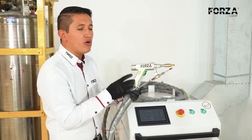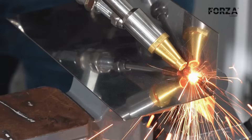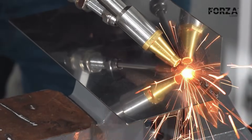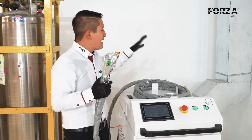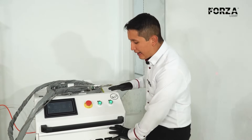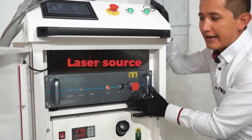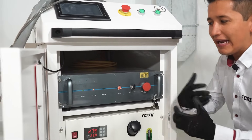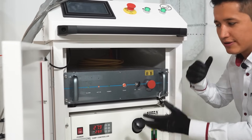All of this is connected to a cooling system and a shielding gas supply. The gas comes out through the tip together with the laser. The laser travels from the source through this hose here. Inside the machine, we find the laser source — the resonator that generates the beam of light, which allows us to carry out welding, cutting, or cleaning processes.